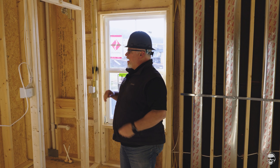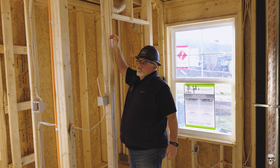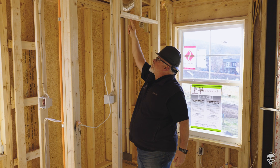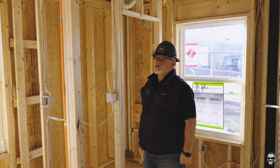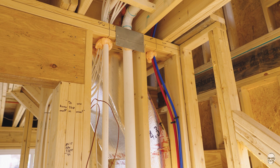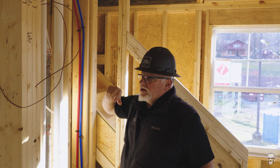When you see wires going up into the floor system like this, all of that is being protected for fire travel. Say this box in the wall caught on fire — they wouldn't want that fire to travel up through the home or get anywhere else. So any place that we have pipes going through, wires, anything like that, you can see up top here we have foam protecting those openings all around. You can imagine there's a lot of spray foaming going on when they're doing this.